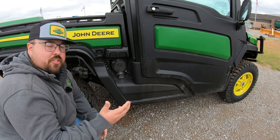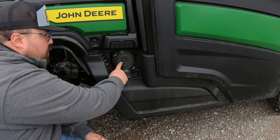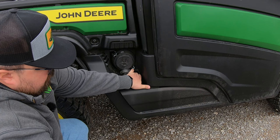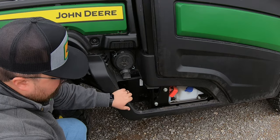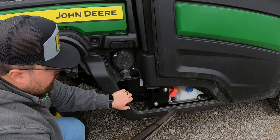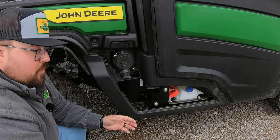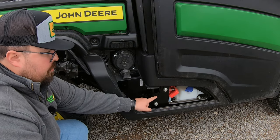Moving over to the right-hand side or passenger side of the machine, we really have only two main focal points. First is the air filter located right outside the passenger door, easy to get to. Then below the air filter is a very important panel — simply push down on that tab and pull out on the panel. This exposes the fluid reservoir for windshield washer fluid, the battery, and the charging point for the battery. That way, if we're having to jump this machine, we're not having to completely get underneath. We have a charging point and a ground point right here.